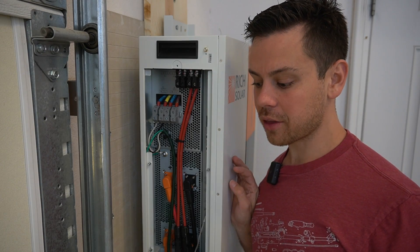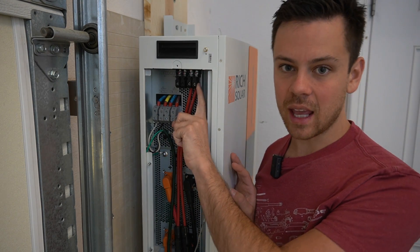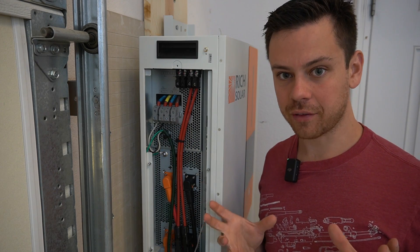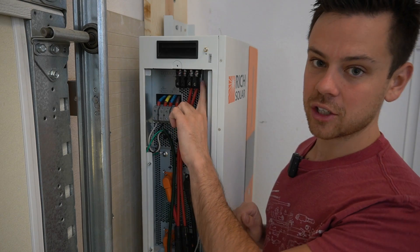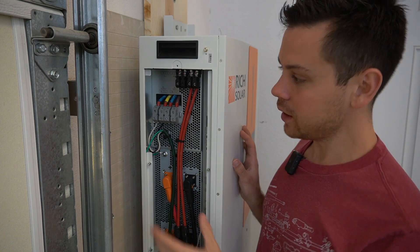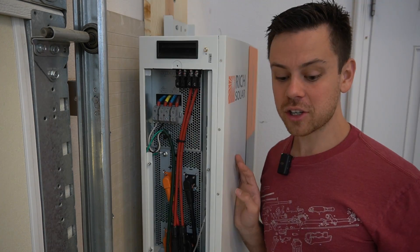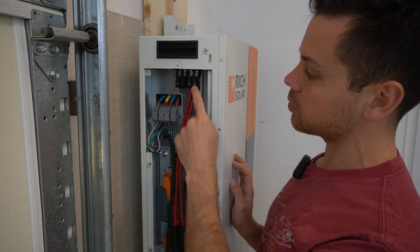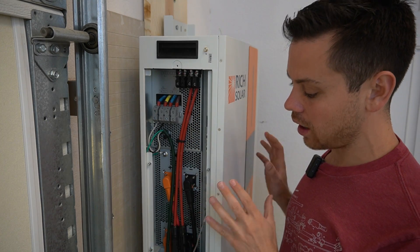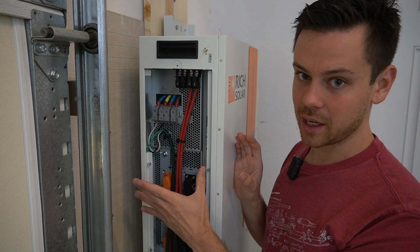The first downside — and why I threw this in my backyard for a month because I thought it was unusable — is because there's high-voltage AC at the MPPT terminal. Typically on all-in-ones, when you remove the cover, it turns off the inverter and there's no live AC voltage at the terminals. But on this one, when you remove the cover, the inverter can still be on and you can have a life-threatening live AC voltage on those terminals. I tested it with my meter and it blew out my meter — this was over 10 amps to ground. You cannot turn on the inverter or add power until this cover is back in place.